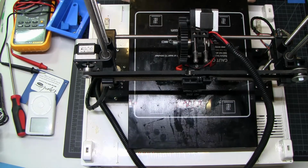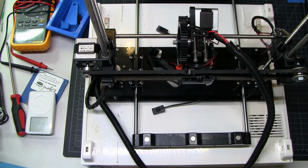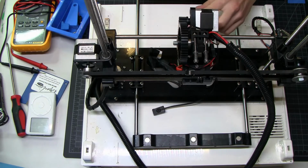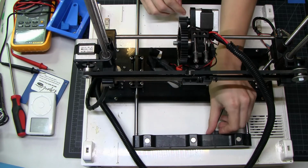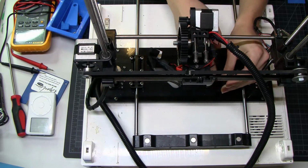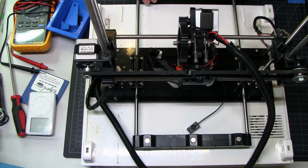But when I lifted this off, and I did have to unplug something under here originally, I unplugged the bed heater in the process, I found that the Y belt has these two things that plug in on either side, so they plug into a little slot in here, and that's what those screws were doing, but both of these had their ends snapped off, so I glued those back together. I'm sure that'll last all of 30 seconds of printing, and just give this a listen.